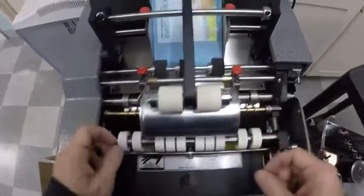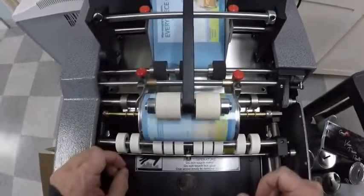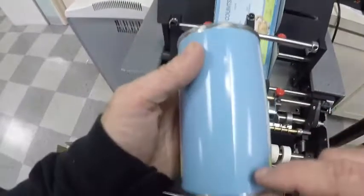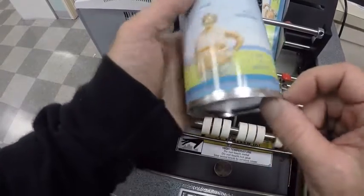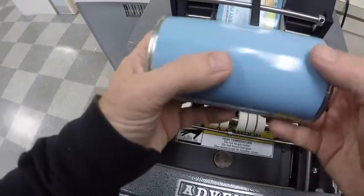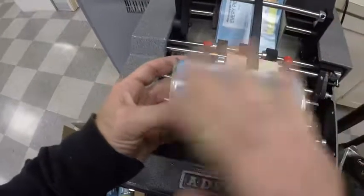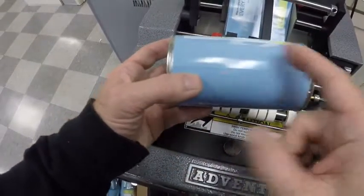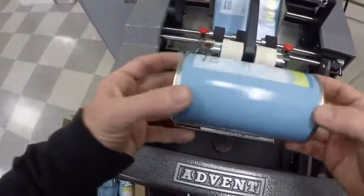We're approaching our last two containers. You can see here — perfect overlap. It's rated within a sixteenth of an inch. You can see the importance of the clearances. It's especially important on this container because these containers are not perfectly true. So if you don't have those clearances — and that's what happened with one of your other container sizes where the label width was sized from edge to edge — those will not work. You have to have some wiggle room. That's very important.